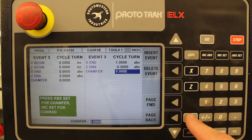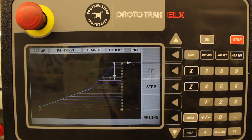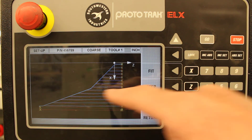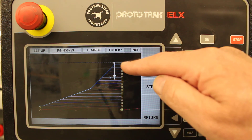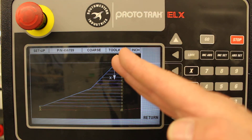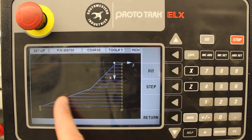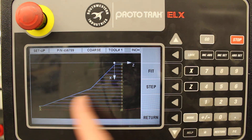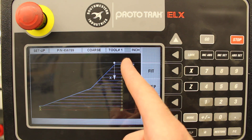Mode, setup, toolpath. Perfect. So what you see is all the roughing cuts here — all the roughing cuts shown. And you can see the finish cut, which gives us the profile. It only shows you half of it since on a lathe it only does the cutting on one side as the part rotates. You're seeing the rough cuts from X plus all the way to X zero.